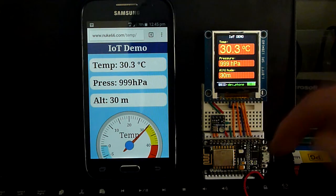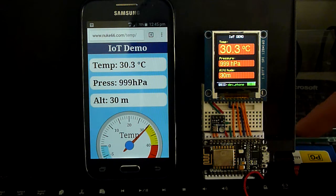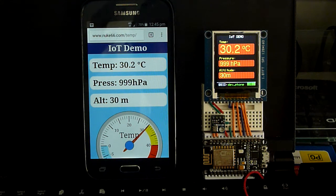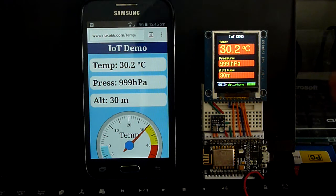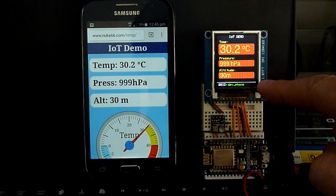It shows the number of how many bytes are in the message, which is important because one of the limitations of the ESP8266 is the amount of data it can send. It doesn't have much memory for sending SSL encrypted messages, and apparently if you make it too large it will cause problems because it runs out of memory.